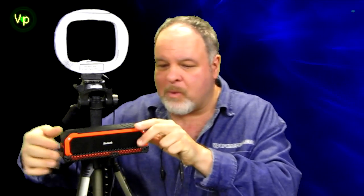It's essentially an energy speaker, but I'm calling it a long-range audio to EMF, because that's essentially what it does. I have it mounted on a tripod right here, and it's real simple. It's a Bluetooth MP3 amplifier. I've taken the left speaker, and it's still in there physically, but it's not wired up anymore. The back of it now has an RCA plug where that speaker was electrically. So when you turn this thing on, you're going to get right channel audio, but you're not going to hear the left channel. That audio signal, which is about 5 watts, is now going to go to this EMF coil.